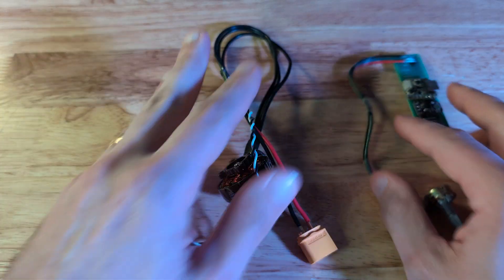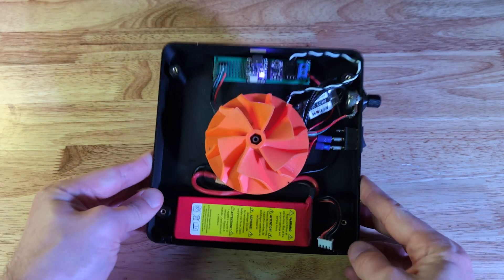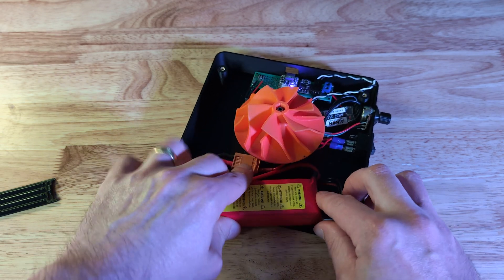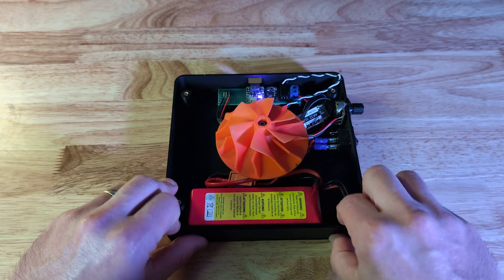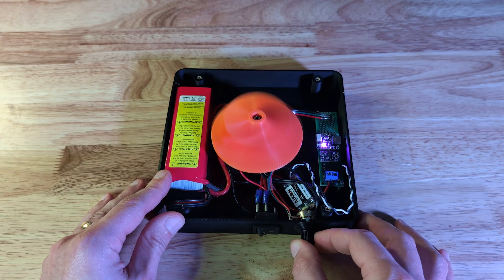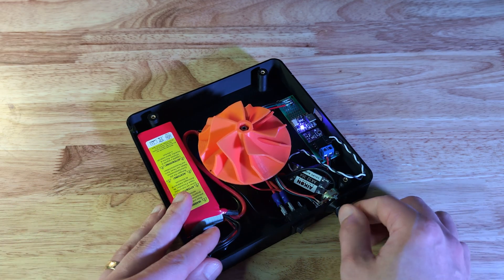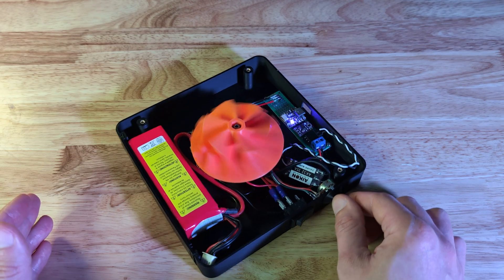Let's hook the perf board and ESC up to the battery and connect it to the rocker switch. It got a little messy, but here we are. It's important to make sure that the battery cable is long enough so that it pokes out of the case — it's just not possible to connect the battery otherwise. All there's left to do is assemble the rest of the stencil fix and flash the program that reads the pot's position and controls the speed of the motor accordingly. Something I learned from earlier tests is that the ESC and motor are really responsive to speed changes, which together with the inertia of the impeller will lead to the entire assembly spinning around its center. So I added a low-pass filter in code to smooth out the changes, which really helps mitigating this effect.